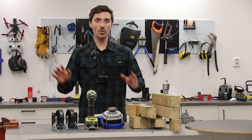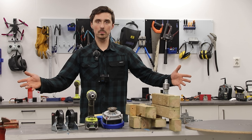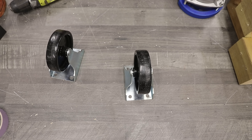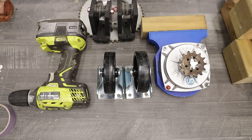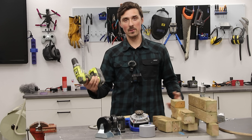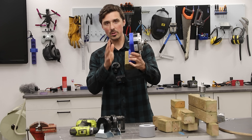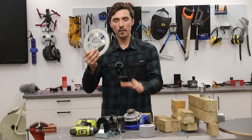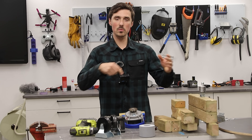I dropped that idea, but still built the turntable, disassembled it, and now we're building it again because someone out there might find it useful. Initially I figured the power drill was strong enough to turn me around — easy. I was way off. I needed a six-to-one gear reducer coupled with a four-to-one gear ratio in order to have a smooth rotation.